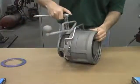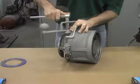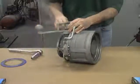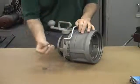With the coupler open you can begin disassembly. The first step is to remove the handle using a 17mm or 11/16 inch socket. Remove the nut. This is a special lock nut with a deformed thread.